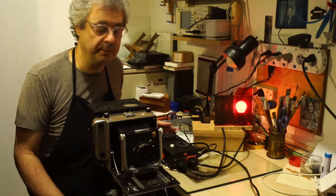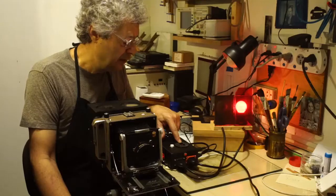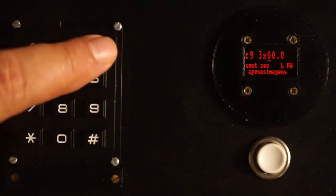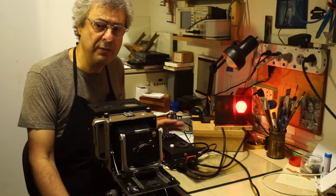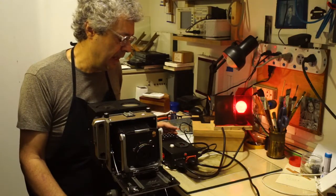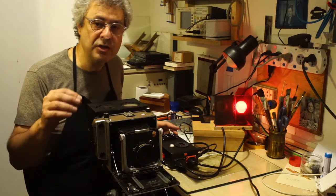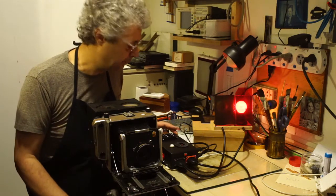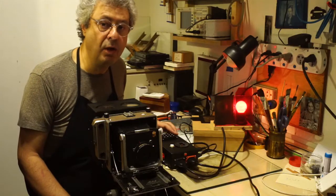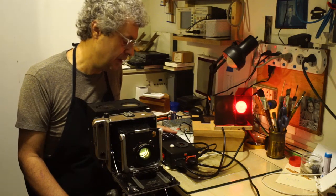Now you have to program the exposure. The first line of the screen shows the contrast level — five is middle contrast. Let's say I put nine to show the color of the highest contrast, and I want three flashes of two seconds. If I press the start button, there it goes — this is a mix of blue and red, it's the highest contrast level. When it finishes, there's a longer signal to tell you it's done. Now let's say I want contrast zero — the lowest contrast level, which is only green and red — then I go for the same three flashes.